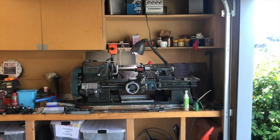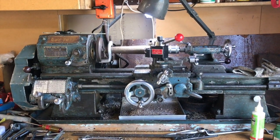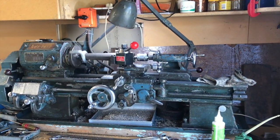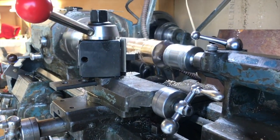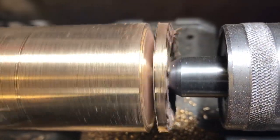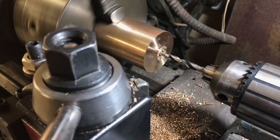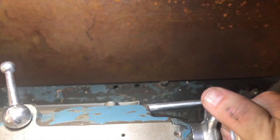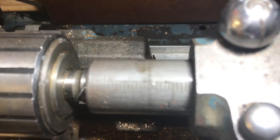I get most of my scrap material from a scrap metal dealer. This piece is quite regular in shape, so I'm turning it between centers — I've taken the chuck off and replaced it with a dead center and a face plate which has a slot that connects into the dog clamped onto the work. At the other end there's a live center, and the work is being cut with the power drive. Here you can see the live center in action with the center actually rotating in its ball bearing race. Now I'm drilling a hole in the block ready for boring a hole in the center for mounting the ball bearing race, using the tailstock to drive the drill and locking it down. You can use the calibration on the tailstock to determine how deep the hole has been drilled.